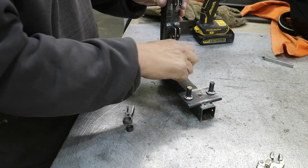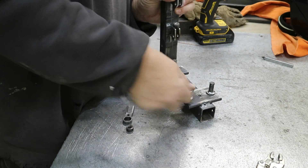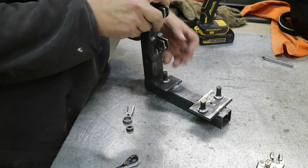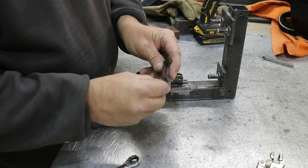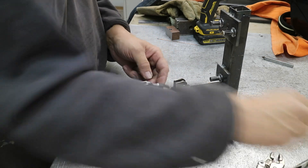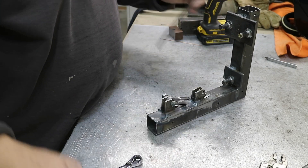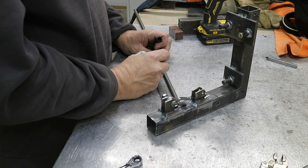There are two of those on the flap — one on each flap, two on the plane. The other thing I need is the bearing holder. I've got a little spacer to simulate what the bearing would be, and I just put it in place. I get about seven inches from here up to fit on the standoff, so I'm going to take a tube and cut it seven inches — that'll be my starting point for fabricating that tube.